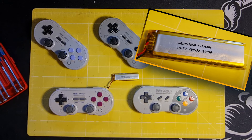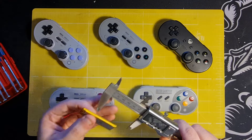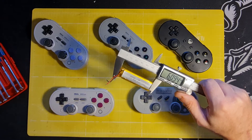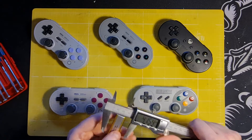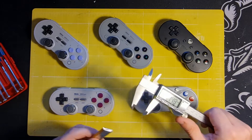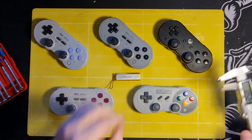I can prove that with my calipers. Measuring the length first - about 60 millimeters, 60.9 to be precise, which is pretty close. There's a little bit of distortion on the edge. The width is 17.2 millimeters, a little less than specified, and the thickness is 4.5 millimeters. Brilliant.